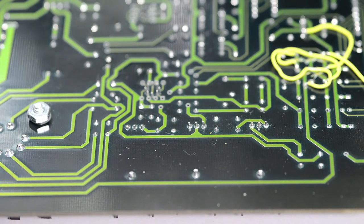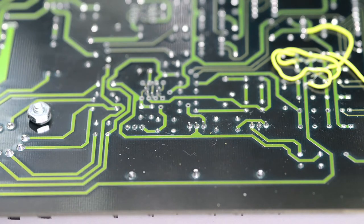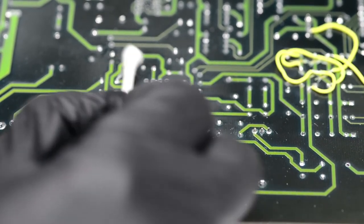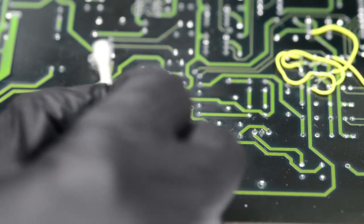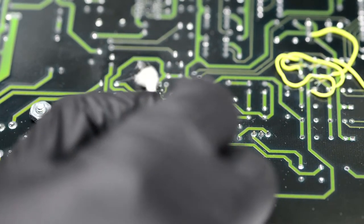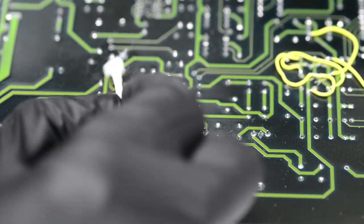And plus the nanovoltmeter with the EM810 module. But that nanovoltmeter is just giving you the last bits of resolution, maybe the last two or three digits. It does not give you the majority of the stability contribution from the whole setup. But they do need very, very low noise nanovolt detection to be able to determine those super small changes. So that's why it's using the EM810 and not just a usual opamp with some high gain. So that's the idea.